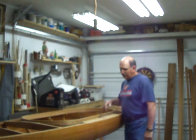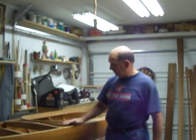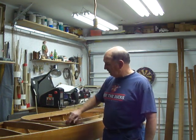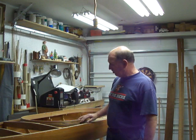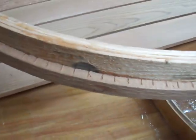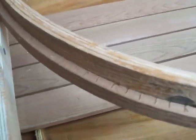Because I'm going to have decking that butts up against the edges, I needed something to settle against. So I took strips of redwood, measured them to length — they were straight and I had to make them curve. I took my scroll saw and scored all along the back, and as you can see, it bent quite nicely. I coated that with a thick coat of glue, and a lot of that glue got down into the cracks. So essentially it's pretty solid — it doesn't move. Everything's good, and that strip is in there.